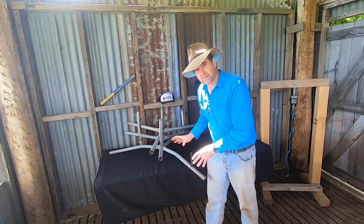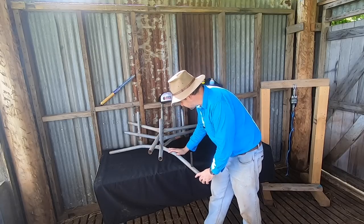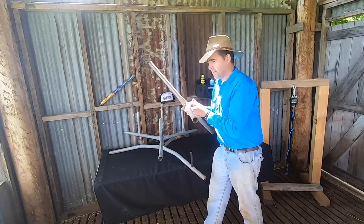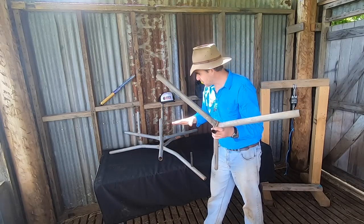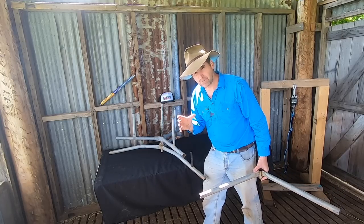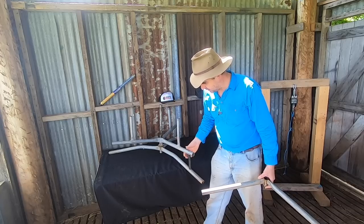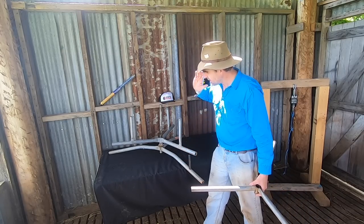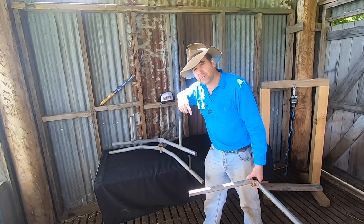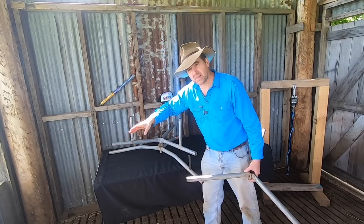These spinners are designed to be placed on the ground and have wire run out from them by hand. The design is universally simple: a stand with a shaft coming up through the centre, supporting a top brace that keeps the coil in place and a bottom support with bars pointing up to keep the inside of your coil located centrally. With this sort of spinner there is no overrun protection — just a simple brake. If you pull really fast and then suddenly stop, the coil can continue spinning and the sixth or seventh coil in your pack can slip out over the base and cause a jam.